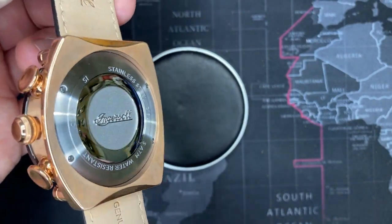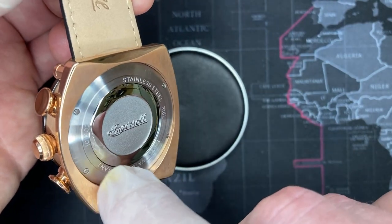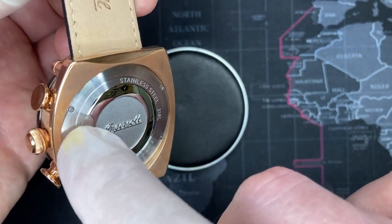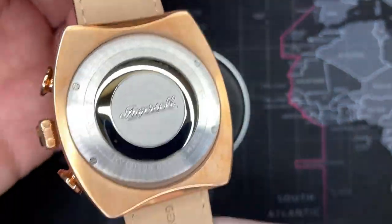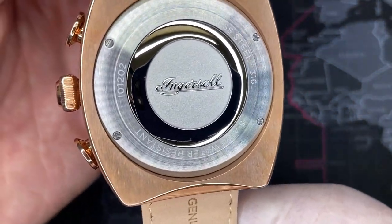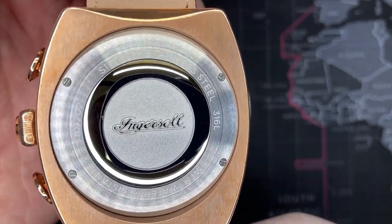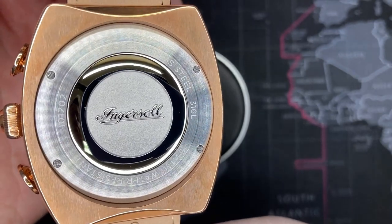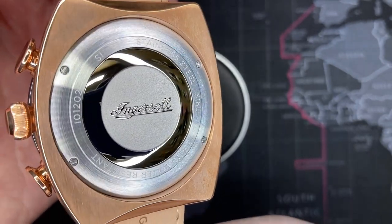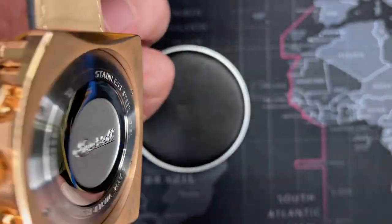So got the watch back together. It's very nice. It's a compression fit using the screws, and they were solid in there, and I will say that they also had some watertight sealer, sort of a thread lock. For anyone who's ever replaced a water pump on a car, you would know it is the exact same stuff, and that's what I used when I reinstalled these screws.